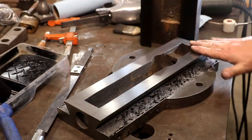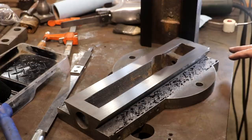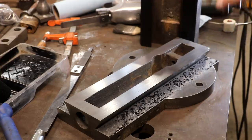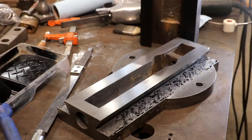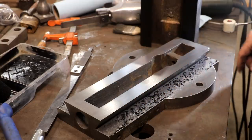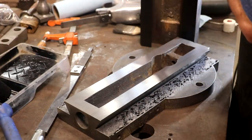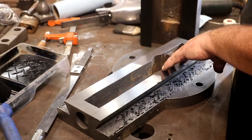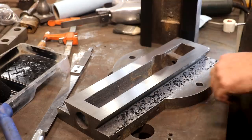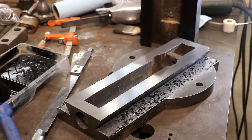I ended up taking it to the surface grinder and took five thousandths off, and that gave me plenty of extra room up top with no interference. I've been back to scraping and I'm probably about done — we're printing off the compound with individual high points, probably 20 points per inch. I'm happy with it. The other side looks very similar. Next I'm going to work on the dovetail that goes in here — I need to match this dovetail, then turn around and do the other side to make sure it's parallel. I'll probably use a straight edge on it. After we make a new gib, we'll scrape the gib to match this side.